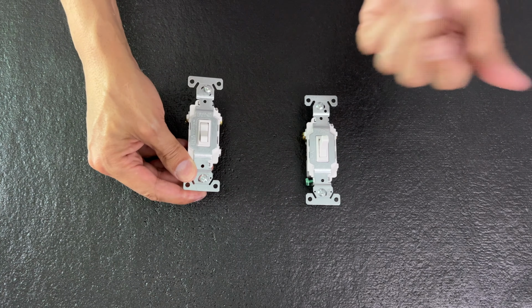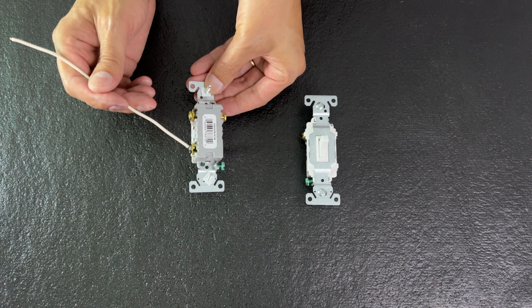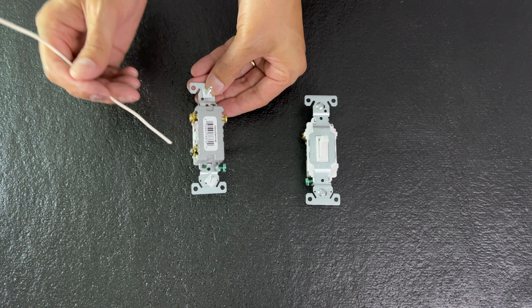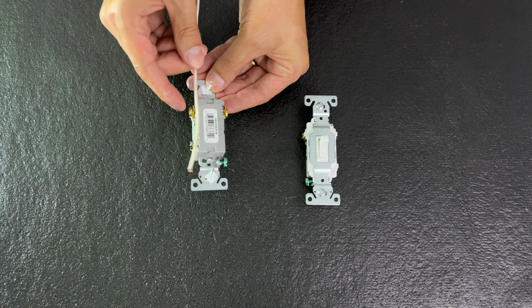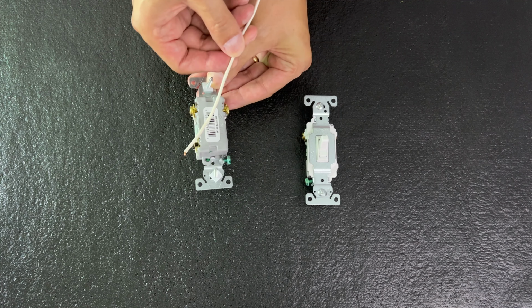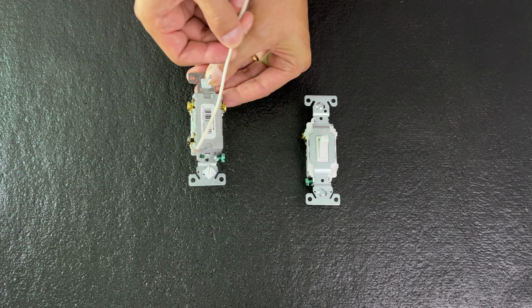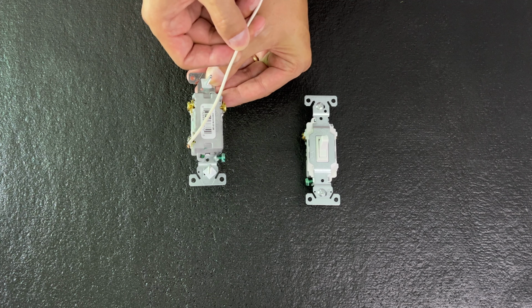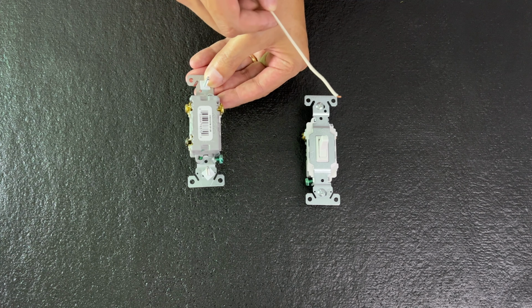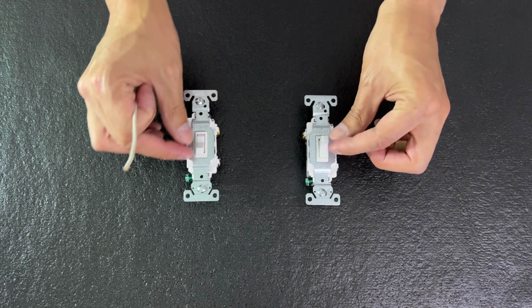But what's happening inside a three-way switch? This black common screw always has power. It's always live on switch 1. Now, when you flip the switch, it's always connecting either the traveler number 1 or traveler number 2. So it's actually just toggling back and forth. So it's just a switch. It's like a railroad track changing directions, and that's all. That flow of electricity will turn on your light fixture no matter what position the opposing switches are on.